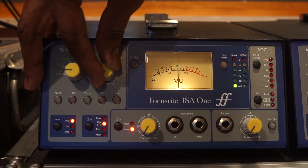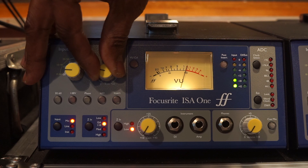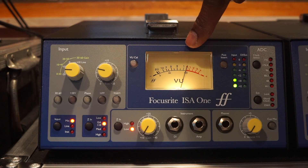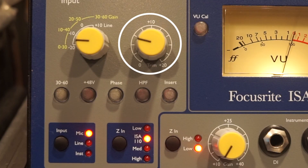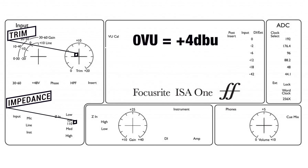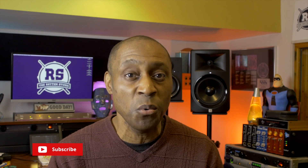Step three: go to your ISA-1 and slowly bring up the trim knob. It must register zero VU, which represents an output level of plus 4 and also registers negative 18 dB full scale on the LEDs. Note the position of the trim knob once zero VU is reached. With the ISA-1, you get blank setup sheets in the back of the manual — it is wise to note this benchmark on those setup sheets for future reference. You can now be sure that you have an optimized starting point for setting levels for any source that you are about to record.